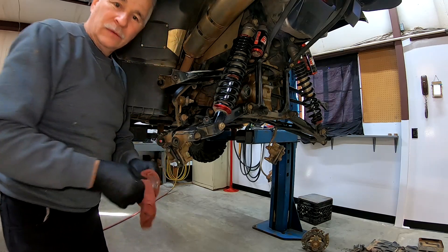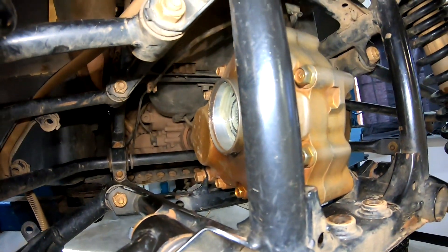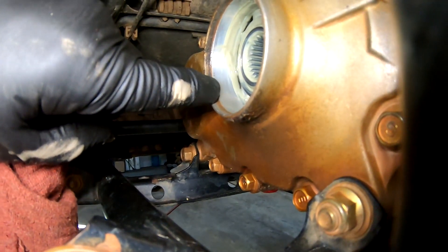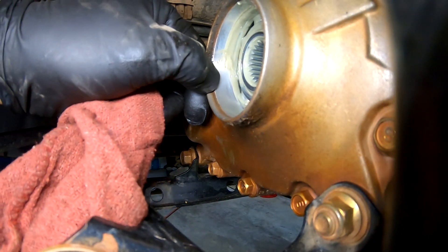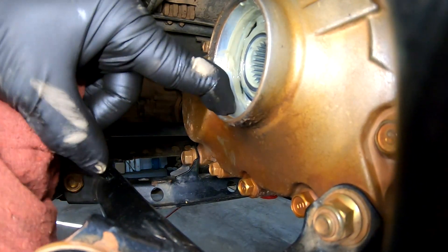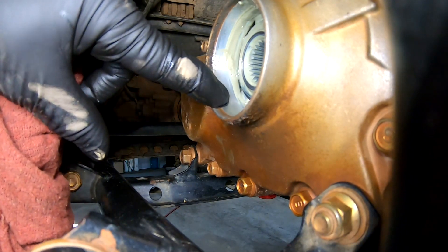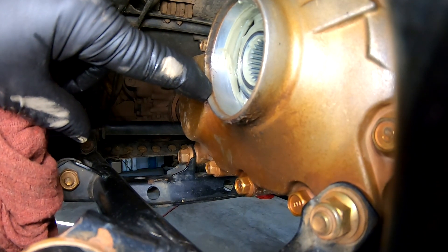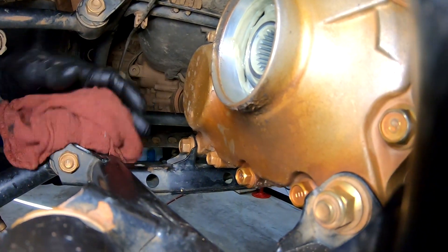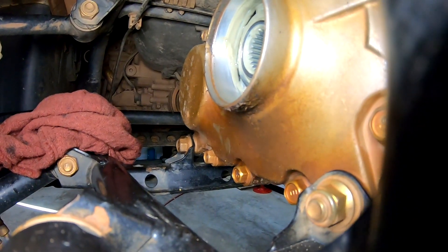Yeah, there's no edge — like I was saying. Wait, okay, there IS an edge right here. So we're gonna put it flush with that. There's an outside edge in there and it becomes smaller right there — that's a smaller diameter. So I'll put it flush with where the smaller diameter is. That's kind of your marking for how far to shove the seal in — right there on that edge.